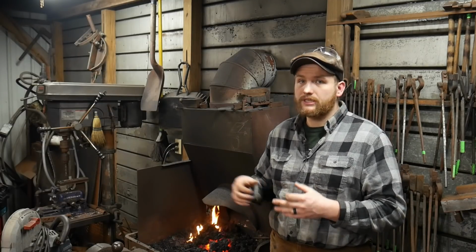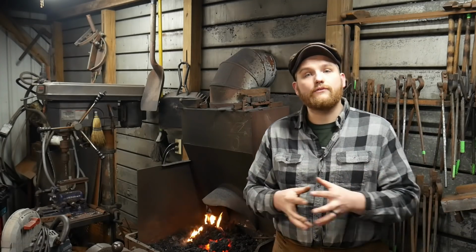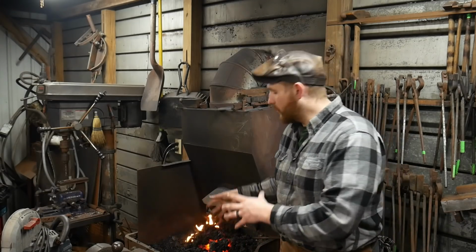Now, that brings us to the next little tip here. You have to assess where you're at, what your local fire codes require you to be doing at the end of the day for proper clean out and shutdown routines. It's generally accepted as a whole across the blacksmithing community, for the most part, that you should pull out your fire. That means pull it away from whatever air source could potentially be activated, or if somebody flipped a switch and left the blower on.